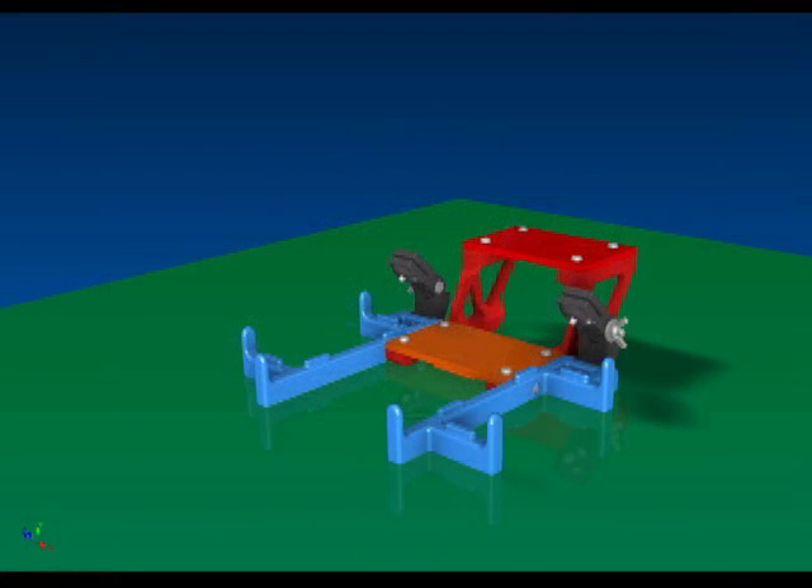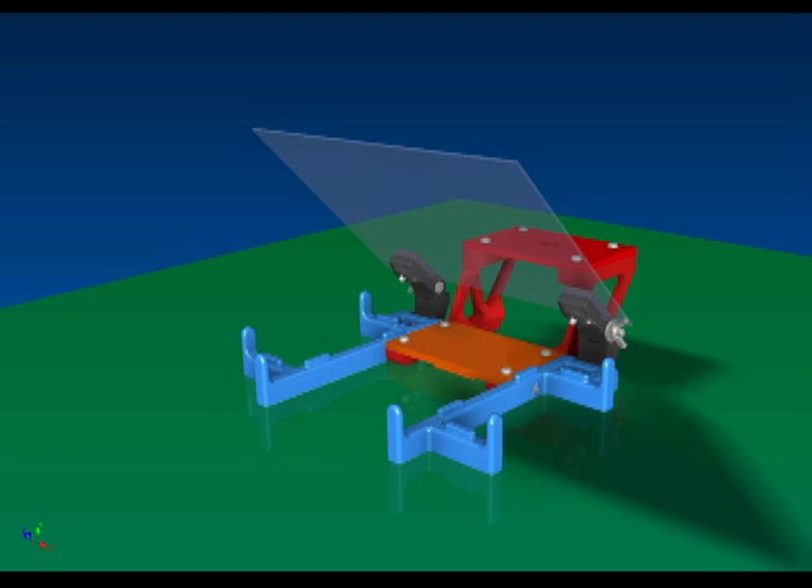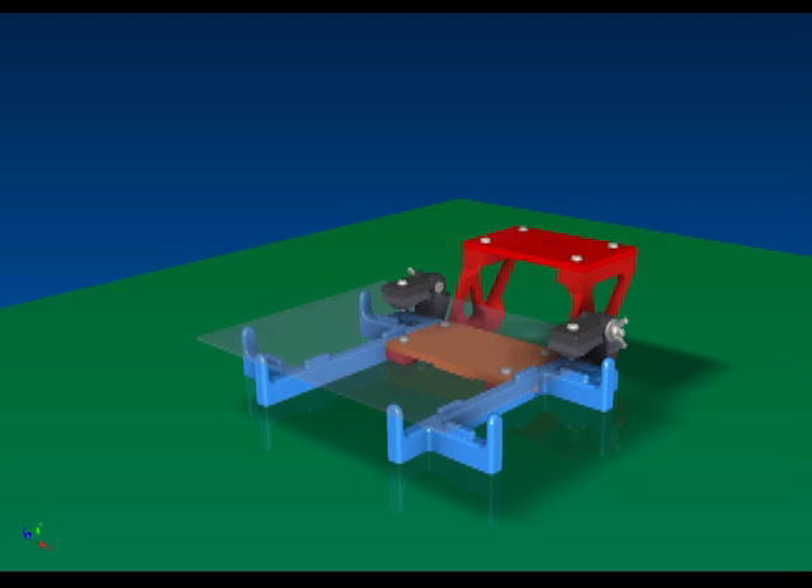The next two sub-assemblies are the hinges for the polycarbonate reflective glass or plexiglass. The hinges allow the reflective glass to be folded down for easy storage when not in use, and the polycarbonate glass is mounted to the upper portion of the hinges using one-inch 10-24 machine screws and nuts. When in use the screen is positioned at a 45-degree angle, and when in storage mode it's moved into a horizontal position by loosening the wing nuts on the hinges to make the teleprompter more compact.